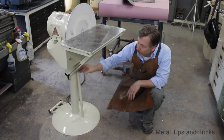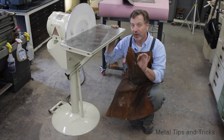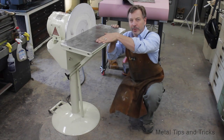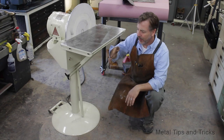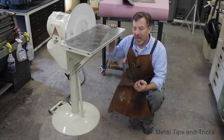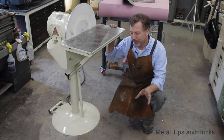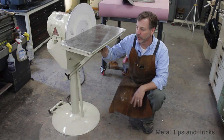Here you see these two vertical supports — that allows the table to tilt down to 45 degrees. I built this for a particular project where I needed to do very detailed work, and I wanted as much support under this table as possible because the items I'm working on are about four feet long. I thought a trunnion system might not have the strength I wanted, plus building a trunnion is complicated and has to work perfectly. I thought this was just a great solution.